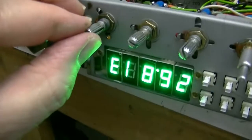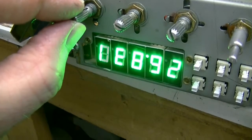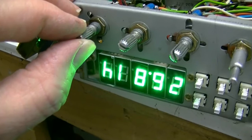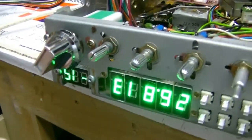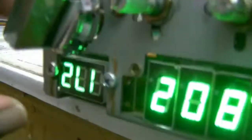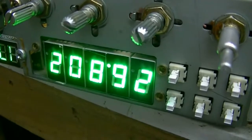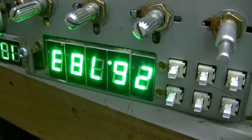Now there's something wrong with the clarifier circuit too. Because if I turn the clarifier circuit up to where this is on 5, see what happens? There's something in the clarifier circuit that's screwed up. I've got to go in and find out what the hell is wrong with that. What I've been doing is keeping it turned all the way counter-clockwise so it doesn't screw me up. That's your lowest frequency. And when you go to what should be 28725, it goes down one more channel to 26802, and then it does all kinds of weird stuff — it keeps going down.